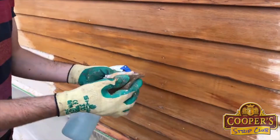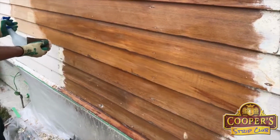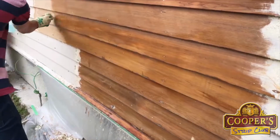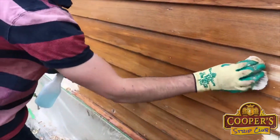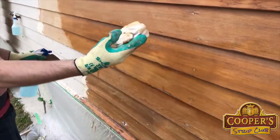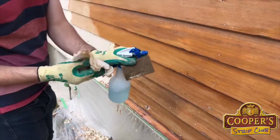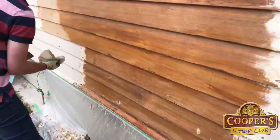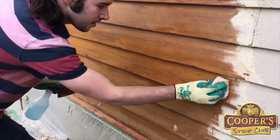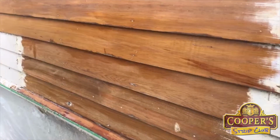We use this rinse, this paraffin-based spirit. It gives you more scrubbing time than if you were using thinners or something like that, and you don't have the odour. It's a far more pleasant product to work with. George, can you show the rag to the camera to see that extra residue coming off? Thank you. So I like to roll my rag as I work, so I don't re-smear on residues. That's right, yeah, that's an important point. As you're going, just in your mind, you're removing residues, not spreading them around.